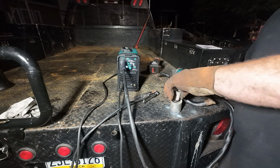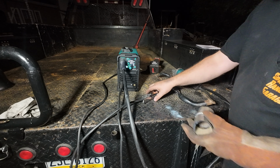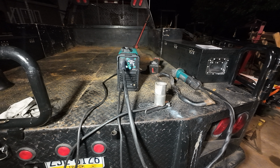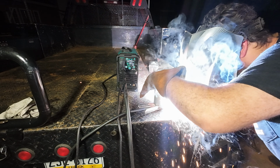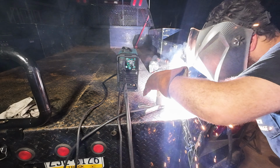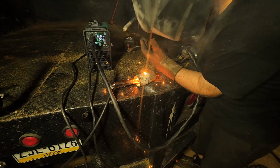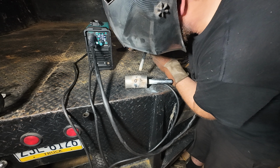We're gonna weld some 16 gauge aluminized exhaust tubing. That's what a lot of homeowners, DIYers, are building an exhaust system from. And I've welded this with flux core way back in the day, and it was really nice to have a gas welder for that. But we'll see how this little BestArc handles it. You know, no wire sticking, no BS. Full penetration, it's not dropping the puddle through. Let's run the rest of the weld at 70, see how that does.